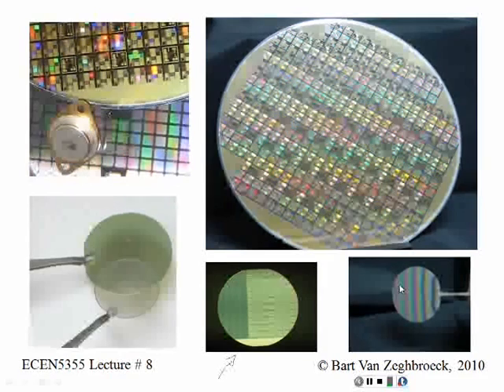Typically you get destructive interference of one color, and you see the remaining color. This particular wafer has a variable thickness across it, and that's why you get to see all possible colors nicely next to each other. The big wafer on top here — the color is diffraction color, just fine lines that diffract light. Depending on the angle, the color changes, which is a clear indication that this is not colored with some sort of stain or pigment, but rather it is just an artificial color, because you only see a fraction of the full-spectrum light that illuminates the wafer.